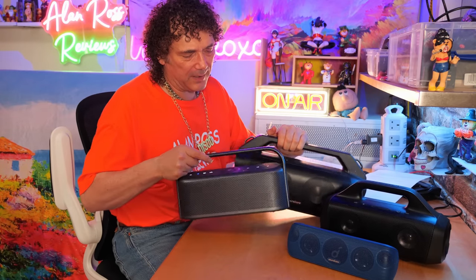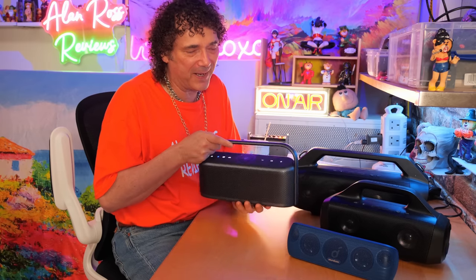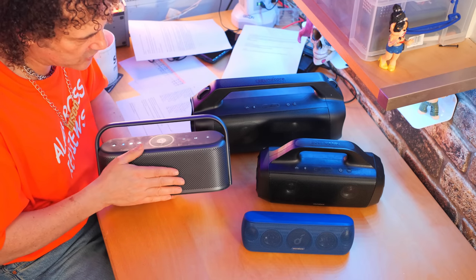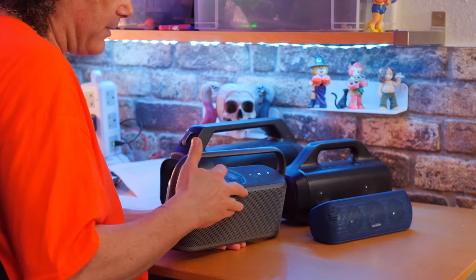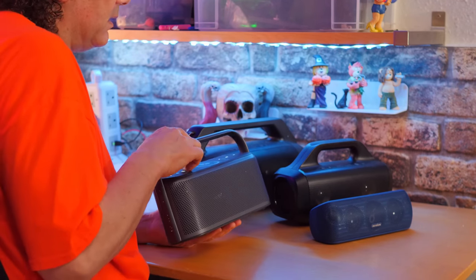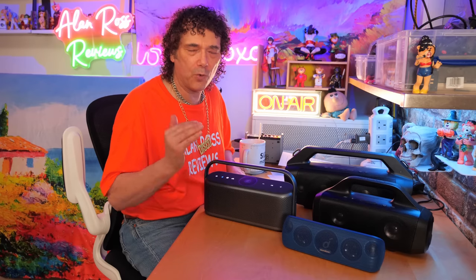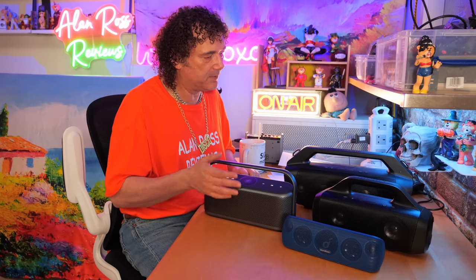I mentioned it's going to be different at all volumes. Mine's tuned for about 60%, because above that it sounds as though it's overdriven, and it's hard on my ears personally. But at all volumes, you're going to start tinkering with that bass button, whether you actually prefer it on or not, and it's going to be at those louder volumes. It will fill in some bass, it will cost you some upper bass, but at louder volumes you may well want to use that. All volumes are different enough that no one EQ is going to be able to cover you for everything.